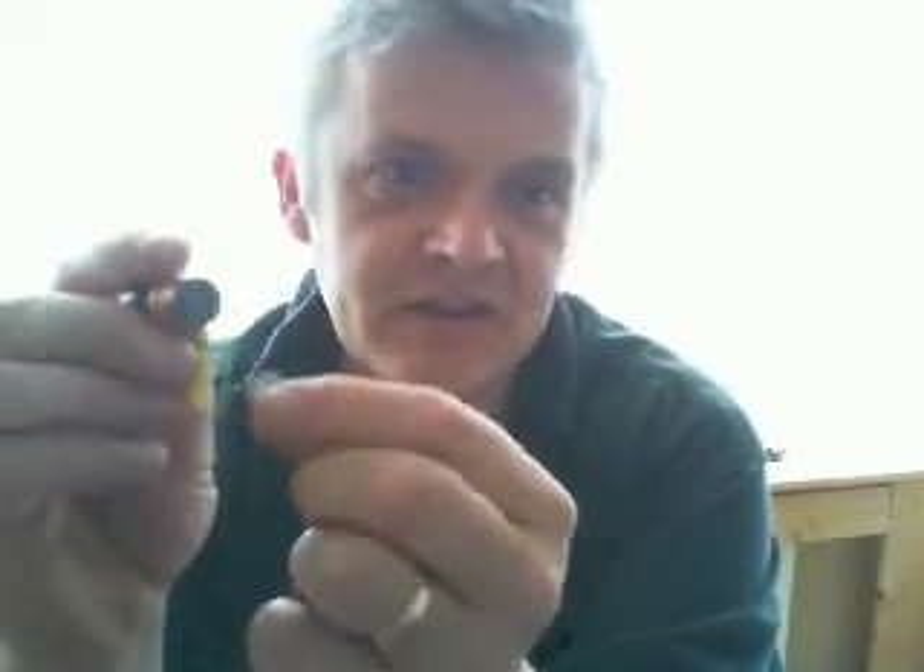What it is, is a small magnet here, which is a little neodymium magnet, a one centimeter one. Behind it is a piece of rubber band — I just cut that from a thick rubber band — and then this, which is an induction coil. You can buy these from Maplins; they have a ferrite coil and a few turns of copper around it, and the magnet will stick to the ferrite coil.